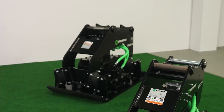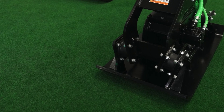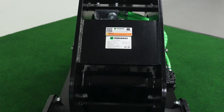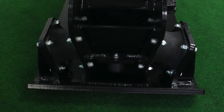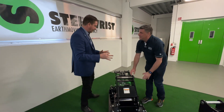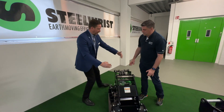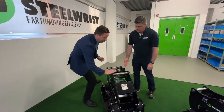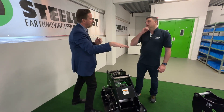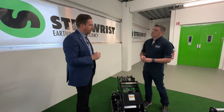We've offered hydraulic compactors previously, but the main difference here is that these have been adapted to tilt rotators — this series has been designed to work under the tilt rotator. For those who look at compactors, they'll see that this shape is really strange, but there's logic to it. The gripper, which is an option on the tilt rotator, takes a lot of room. By positioning it on this side of the compactor, this allows the slope here to get under utilities, so you can rotate the compactor and shove it under a utility or any lines, so that you don't need to get off the machine and do it with a manual walk-behind compactor.